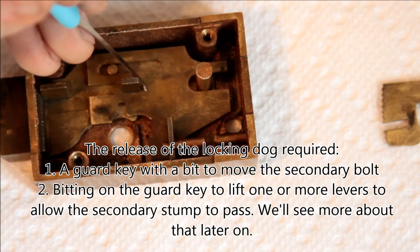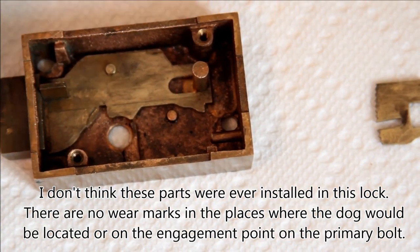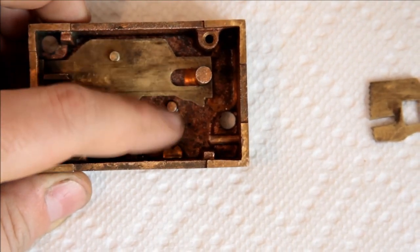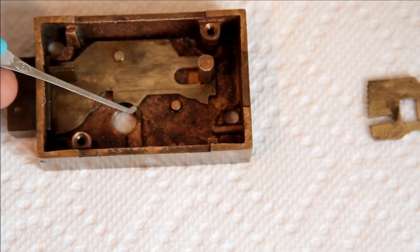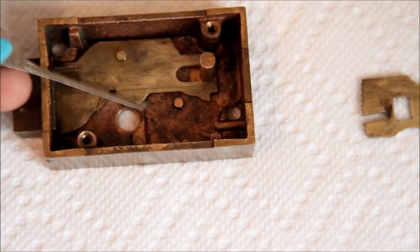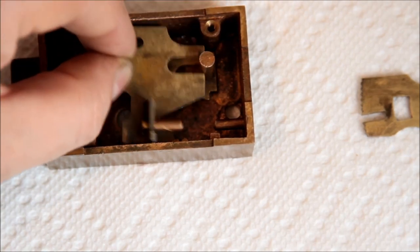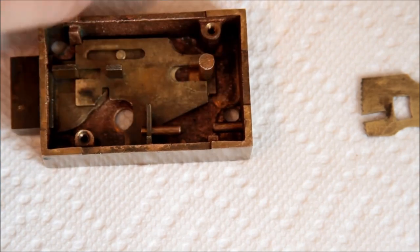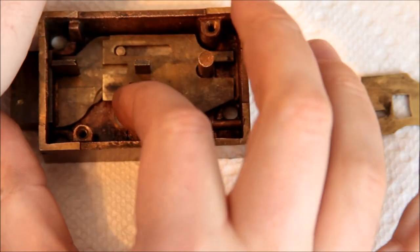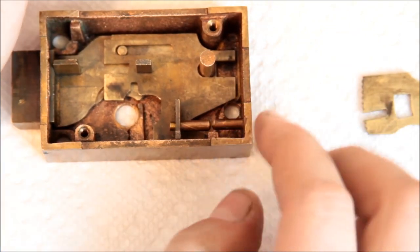They appear not to have incorporated this feature, although the casting still has this little nub here and this little V-shaped groove down here — this would be for the spring. The dog would rotate on that, and this little part of the casting is to prevent manipulation of the dog, so it blocks you from sticking a wire or something in there. That's specifically mentioned in the patent. The dog would block the bolt in the open position, and once the secondary bolt has cleared it, it would go away. I presume this is probably a spring to cause this to retract automatically when the lock is closed, because the renter key does not have a bit at the position that would operate this.